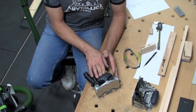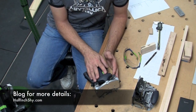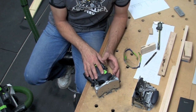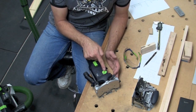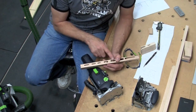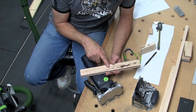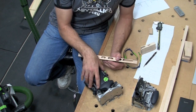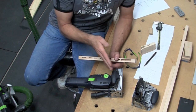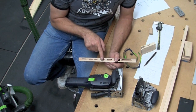A lot of people subscribe on YouTube, but I usually post additional information on my blog, so go over to my blog and look at the entry for this video — I'll have a number of formulas there. They're very simple lookup tables so you can pick a bit width on the Domino and know what size mortise you'll get. Here on this scrap board I plowed some 5mm and then some 10mm Dominos using the widths available on the DF-500 — the exact size, the one that adds 3mm on either side, and the one that adds an additional 5mm to either side. Knowing those numbers, you can estimate the size of these mortises.